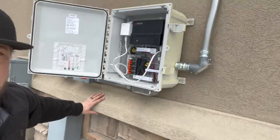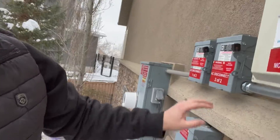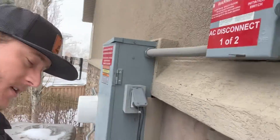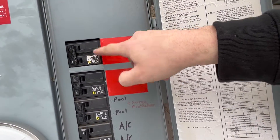Never want to work on a solar panel system when it's producing power or turned on. For microinverters with Enphase, you'll generally have a combiner box with all the different breakers, a disconnect, and sometimes breakers that back-feed — such as a 20-amp breaker and then the main panel. Before you work on a microinverter system, you need to flip all those breakers and disconnects, and verify that the system is off before you touch or disconnect anything. Make sure to be safe and not work on live wires.